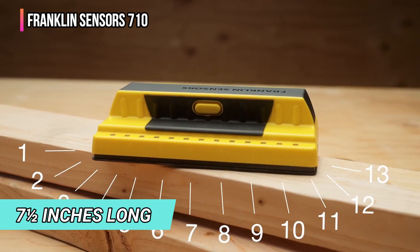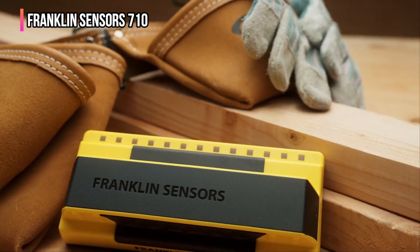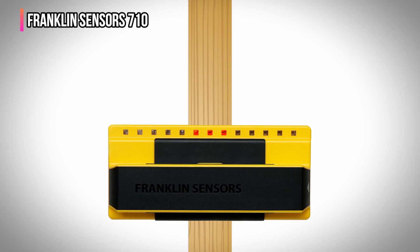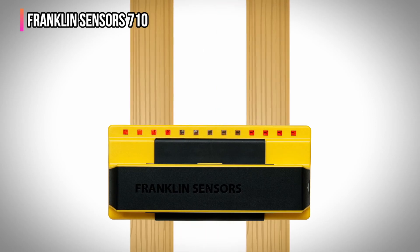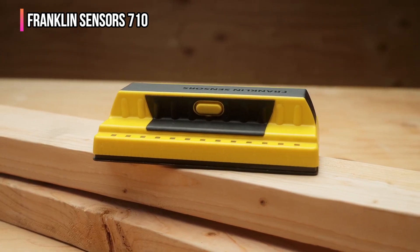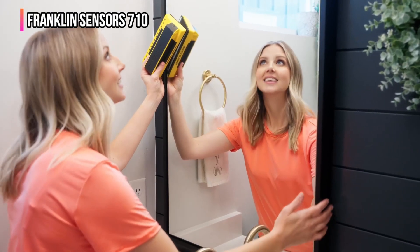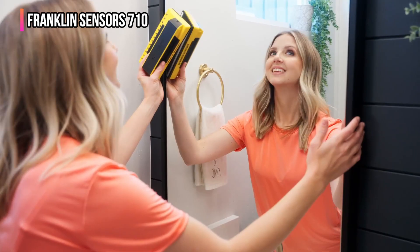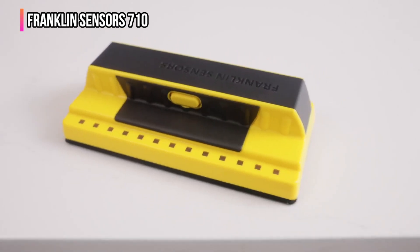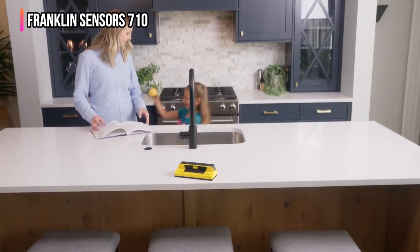The nicest thing about the Pro Sensor is that its scan bed is seven and a half inches long and contains multiple sensors. A series of 13 lights run along the top of the stud finder, and as the tool passes over a stud the corresponding light is illuminated. This allowed me to detect both single and double stud framing members. A seven-and-a-half-inch ruler is also etched into the top. With the Pro Sensor it's possible to detect and distinguish between studs located within a few inches of one another — as near a door or corner — making it well suited for remodeling contractors.